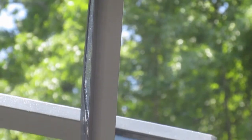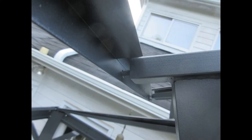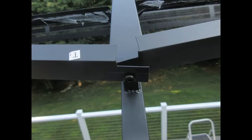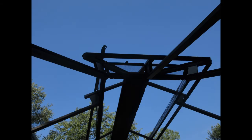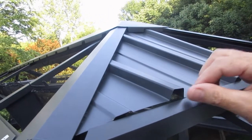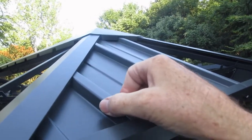The instructions aren't super clear — the screens were popping out and the holes just weren't in the right place. There are brackets that go on the outside. Putting these up isn't too difficult — they're light little pieces, they're the track that the bottom of the top roof panels go into. You just leave them really loose, pop in the roof panels, then tighten down that rail. There are no screws in the top.